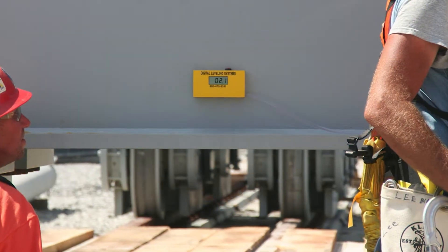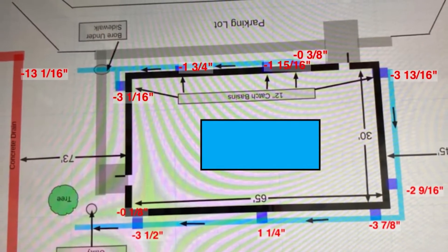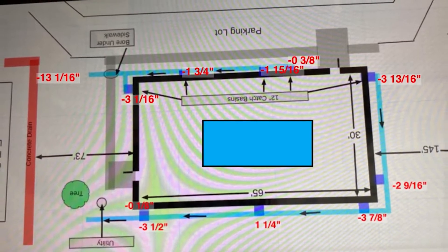One of the major benefits my customers find is savings in time. Before, if you're working a job site up with a laser or another piece of equipment and writing all of the readings onto a legal pad, then transferring that information into your CAD program, you're looking at wasting hours of time. With a piece of digital equipment, my instrument will actually map the site and upload into CAD in minutes, and you don't have all the mistakes and errors you'd have to go back through.